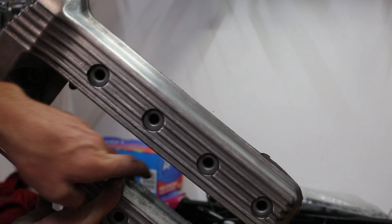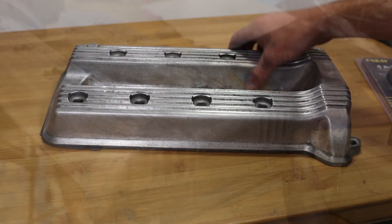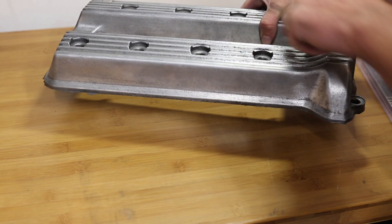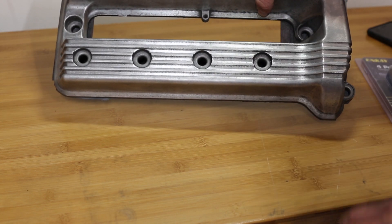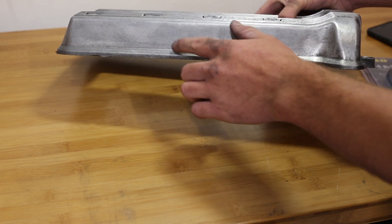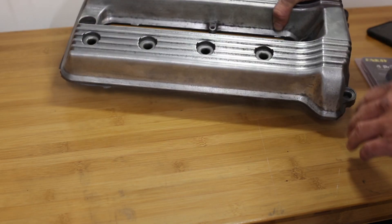For the most part I've run this thing through 150 grit sandpaper. There are still some corners I have to get to, but the main surfaces have been polished up with 150 grit and it's been really time consuming — I think I've been working about an hour and a half and there's still a lot of work to be done. After another hour's worth of sanding I think it's looking pretty good. The end goal is to get the surface ready to take a coat of primer and I think we're getting close. This is a cast aluminum part so there are a lot of pits in the surface that I don't think I'll be able to remove completely, but I can put a coat of primer on it and sand it down further.